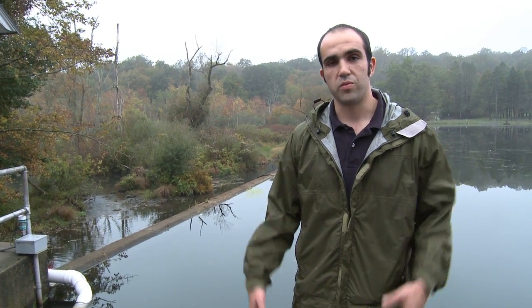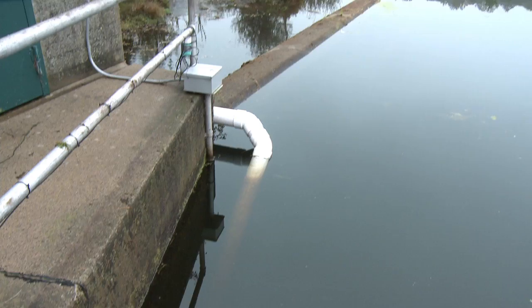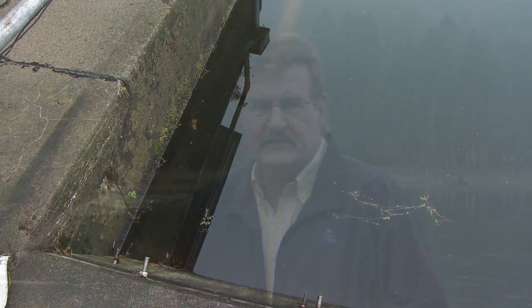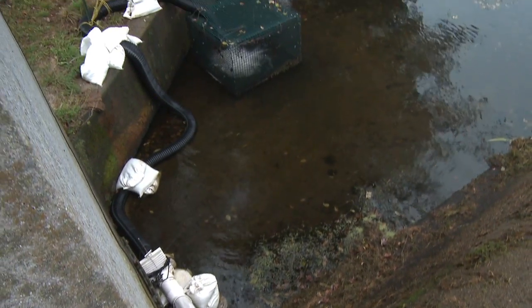The other way out is directly below us — there's a seven-foot pipe that leads down to the Hemlock's Reservoir, which is a dead end for their migration. The third option, which Brian has installed, is a six-inch plastic siphon that supplies the flowing water needed to guide the eels downstream. The siphon is set up in what we're calling a dark corner of the dam, where we've created a plywood background where lights do not shine. The lights move the eels toward that dark corner and into the suction side of the siphon, which runs water over the dam so the eels enter the siphon and are released below the dam.